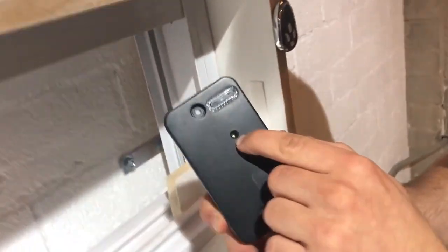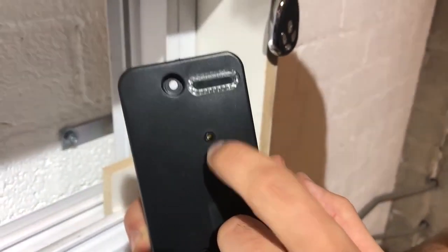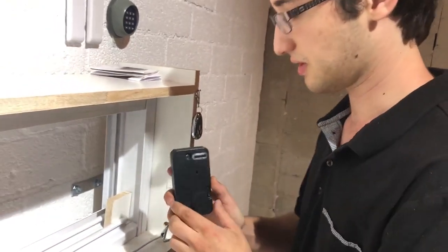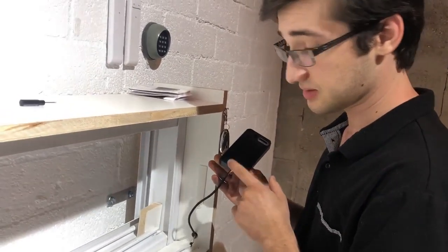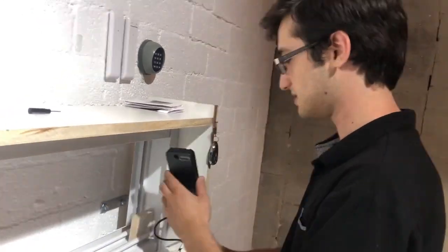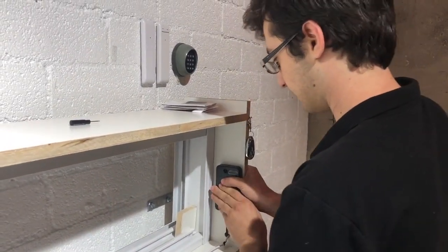There's also a hole here — it's a little difficult to see, but there is a small gold button at the bottom of the hole, and that is for programming your tags. First, take off the casing, plug the cable into the sensor first — don't plug it into the unit yet. Stick it on the wall for convenience, or you can stick it on the wall last.